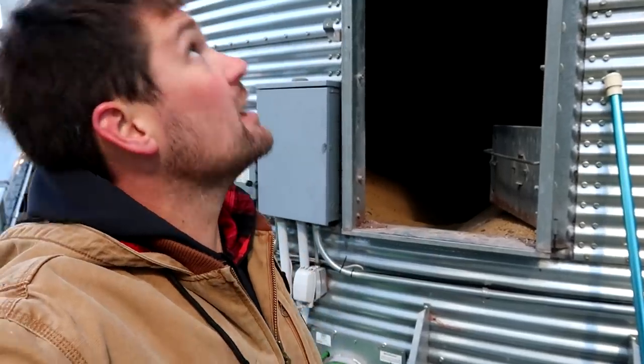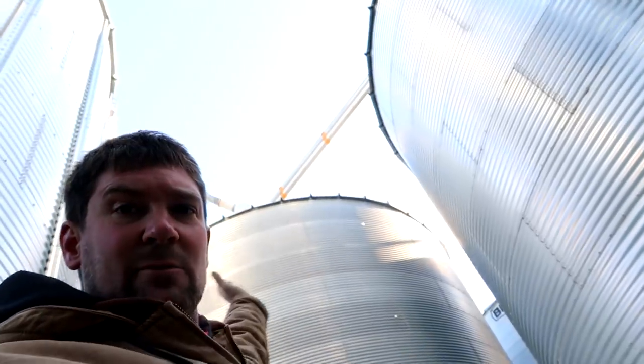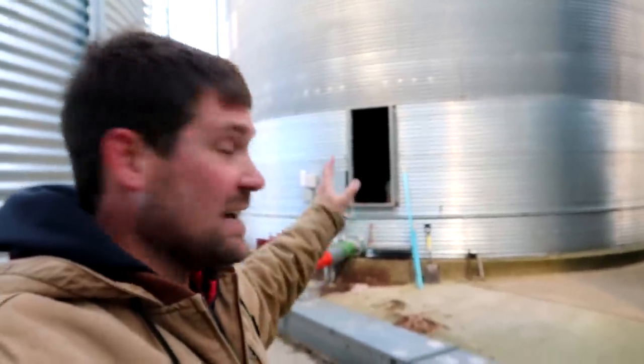Those are last year's beans on the bottom there — we made sure all the sumps are clean and free and clear, which they are. Then we had an issue up top with the overhead conveyor. It's the auger at the top of the bins that crosses right there — that auger had an issue with a broken bolt, so I had to climb up there with a pipe wrench, get that opened up to get the gate opened so we can get our beans in the bin. There's always a lot of shuffling in the mornings during harvest, particularly when you're getting started and everything's just getting going — back and forth, up and down, in and out. You want to make sure everything's right because half this stuff has not run in about 11 months.